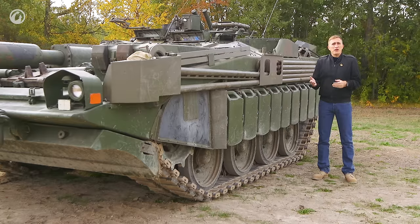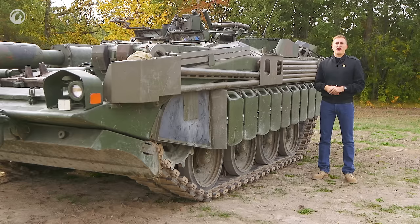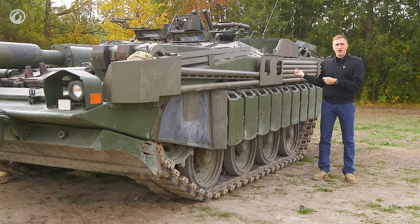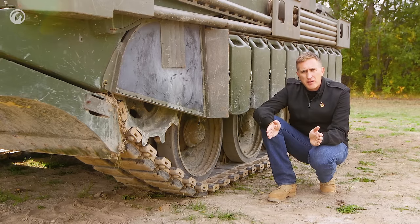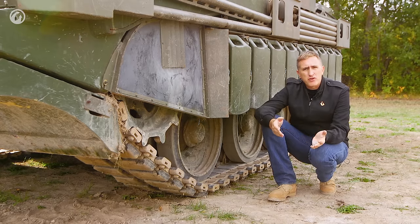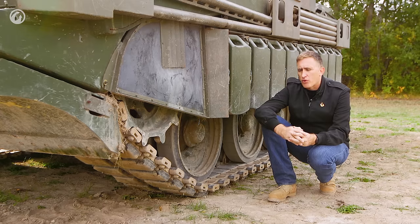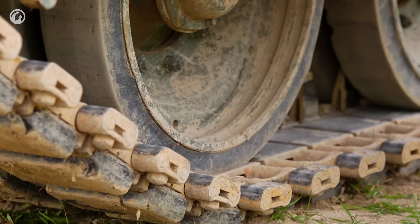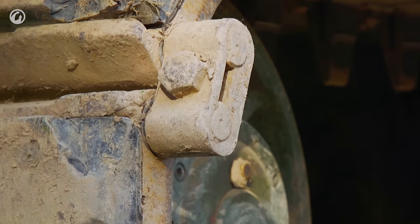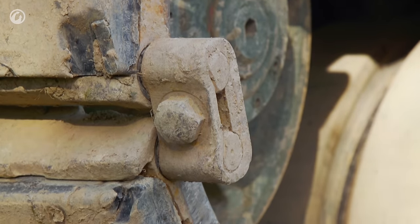Track tension — everybody's favorite part. There's no track tension adjustment on this tank, because the hydraulic elevation automatically applies the tension accordingly, so there's no mucking around with the idler wheel. Initially the tank came with single-pin tracks, 670mm wide, 86 links per side, available in wide or narrow track pads that could be unbolted for different terrain like ice. By the 1970s the track had been changed to a dual-pin deal system with end connectors, very similar to what's found on the Leopard 2 today, reducing to 61 links per side.